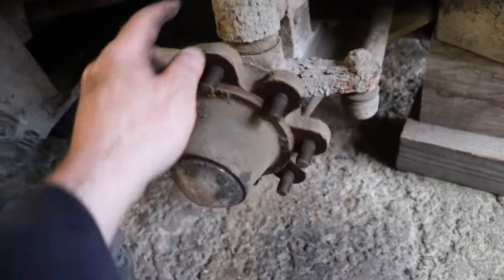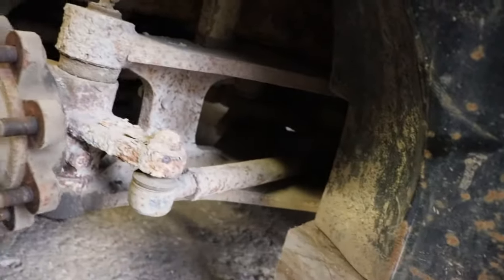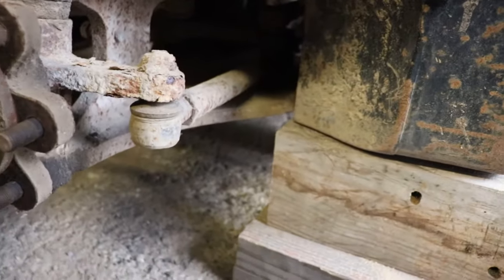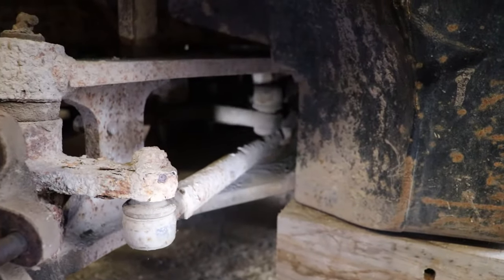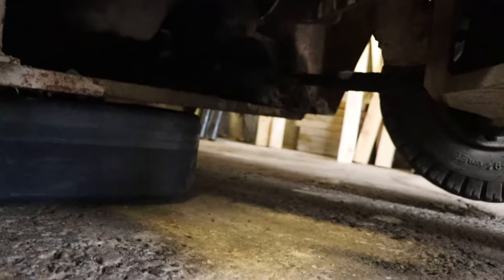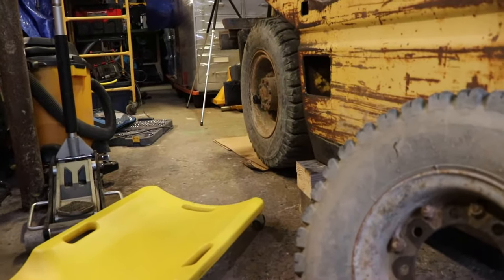You can see how this wheel is bolted together. There's no brakes on here — there's grease points. The tie rod end is not greasable but the kingpins are. This is a packable wheel bearing. There's that center link and the center pivot. At some point I've got to look at those and see what condition they're in. I can see there's a ram for power steering assist under there. We'll go and get set up on the front wheel and see how that goes.